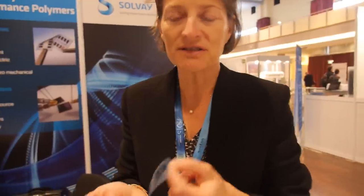We produce raw materials and we have partners that make the devices out of them. The raw material is fluorinated polymers that are inherently piezoelectric. They can be printed — you don't need any mechanical post-treatment. You can formulate them into ready-to-use inks that can be printed on a flexible substrate, using a low-temperature process.